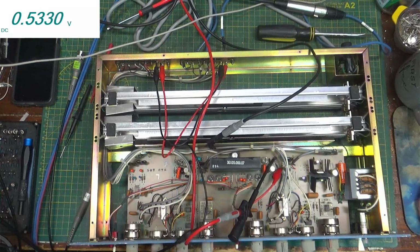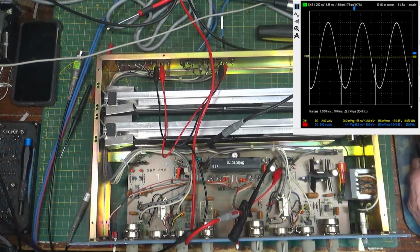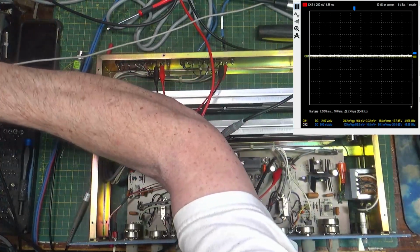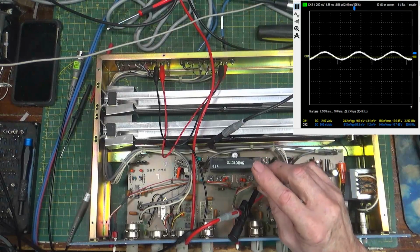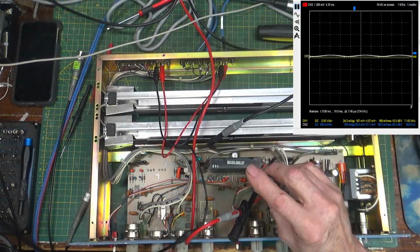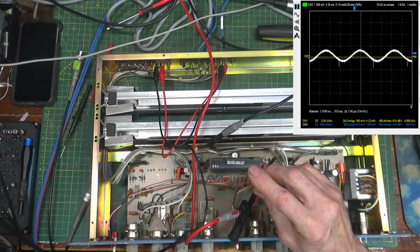That's where it's left. All right, now it says to adjust the input to 5. So I adjust the input to 5, and I turn on the limiting threshold. You see that we went up a different voltage, but we want to look at the scope for this one. And I want to briefly apply 0 level, and then I'll give it negative 30, and you adjust this one here. See it? You adjust it until it quits rising, and it's very slow to operate, so you got to do this very slowly, down, up, ever so slightly, right there.